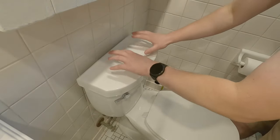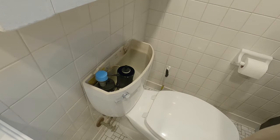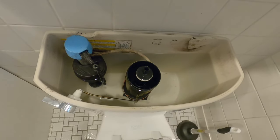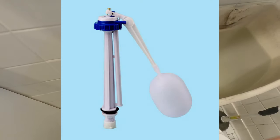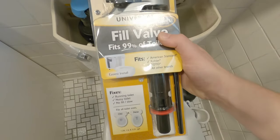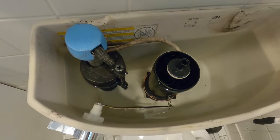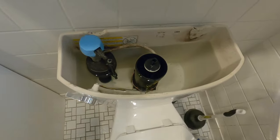The first thing you're going to want to do is go ahead and take the top off of your toilet bowl — it'll come right off, and that'll show you what you have going inside. Now, depending on your toilet — this happens to be a 1.6 gallon per flush toilet — you'll see your fill valve can be a float style like this, or it can also be a ball style. Korky makes one that's universal to just about everything, and it'll actually upgrade from the older ball and float style to the newer setups, so you get a much more quiet fill.